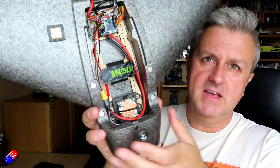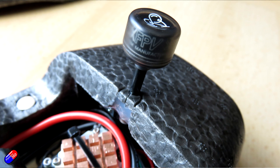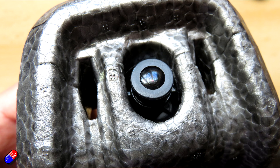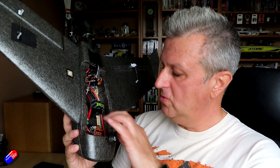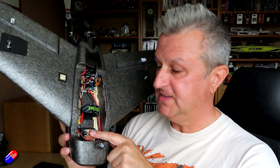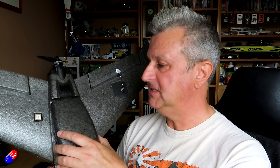The DJI air unit light at the front has massive solid copper heat sinks on the top and bottom, and I'm having no problems keeping it cool. There's a couple of vents at the front and a little air coming around the camera, which seems to be enough at high speed. The one exception was flying in 31-degree heat when it got really hot. If you regularly fly in very high temperatures you might need to cut a vent in the top or bottom to help keep the DJI system cool.